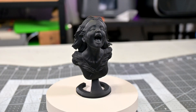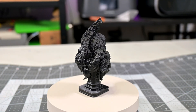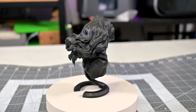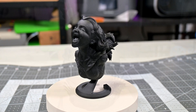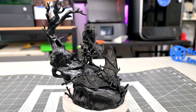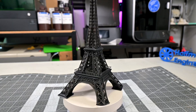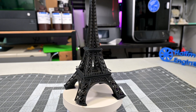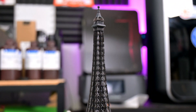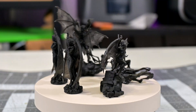Moving to the black resin — the Joyful Yell and Bearded Yell models turned out really well on the M7 Pro. The Bearded Yell in particular looks incredible; the details of the hair and braids really show through. The Joyful Yell was printed almost flat on her back, and you can see some layer shifts from transitions between supports and prints — a different orientation probably would have been better. The Shadow of the Blood Moon diorama turned out amazing: the details in the crossbow and thin arrows printed without issues, and assembly was very easy with parts fitting together nicely. I also printed the Eiffel Tower — it printed beautifully but I broke two feet removing it from the bed. All the interior lattice work printed fine, though there is a single separated layer at the overhang at the top. Miniatures also look good in black, with the standard resin becoming slightly translucent in thinner areas like wings.